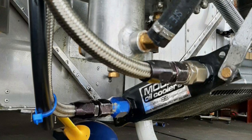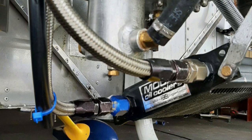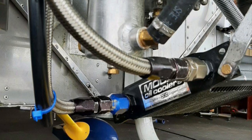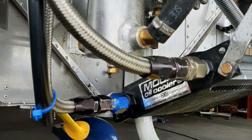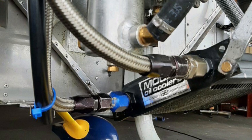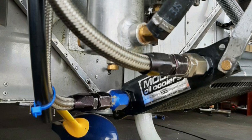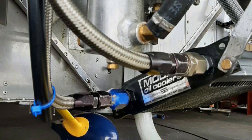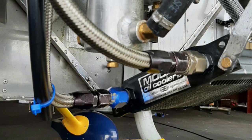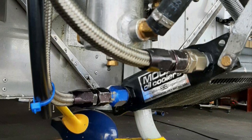Also keep in mind that in a couple of instances where one link of the rubber coupling failed, the engine was perfectly fine to fly and get home or to the nearest airport. However, the builder did not comply with the part of the service bulletin that directs you to move all coolant tubes away from this area and route them around and in front of the gearbox instead.